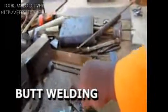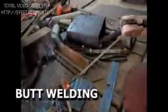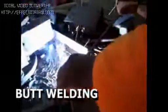It's alright. Now let's say two pieces. We want to join the two pieces. These two pieces now, let's say to join it. Then must they touch each other? Okay. And put the clamp on it. Return circuit to complete the circuit. Join the two pieces together. Now we want to join it to the end. Let me turn this side so that we tack it and then you set it to be properly joined after tacking.